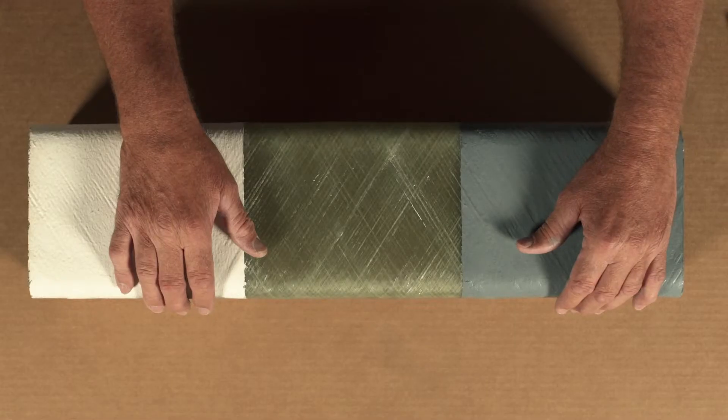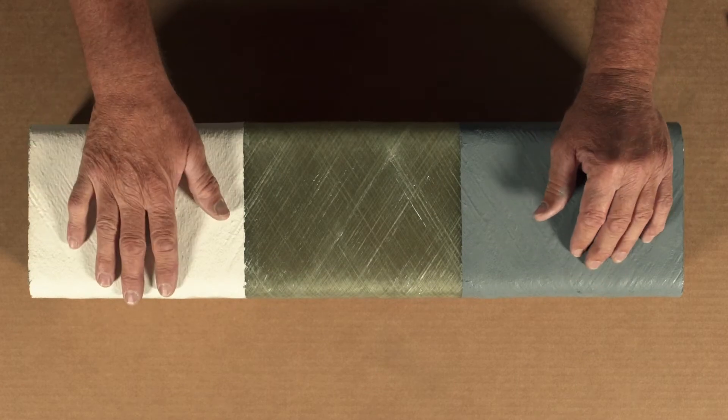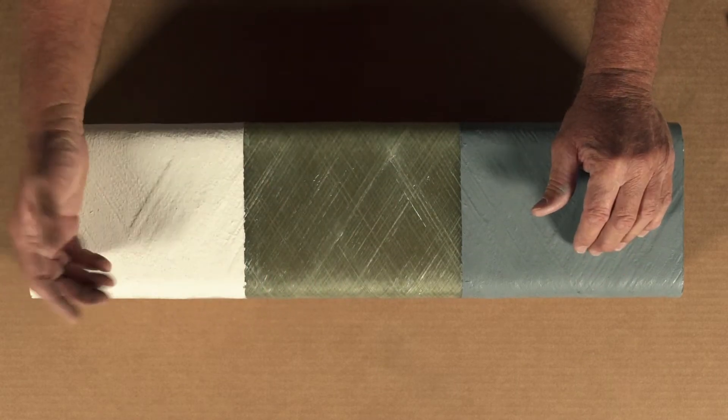Hi, my name is Jim Wischews and I'm the FRP division manager here at Minoxevent. We're going to be talking today about doing gel coat top coating. Similar in some aspects to the wet layup joint which we've covered in another video, however distinctly different because it is not the same material. Gel coat is used in above-ground applications where color choice is preferable and also UV protection in outdoor applications is required.